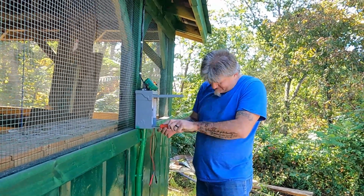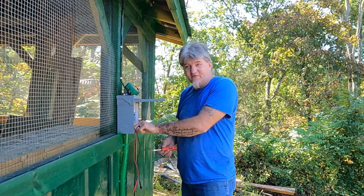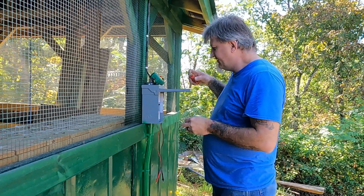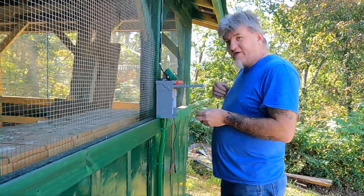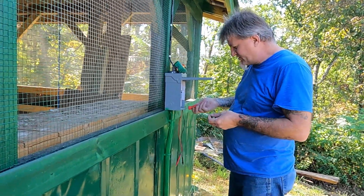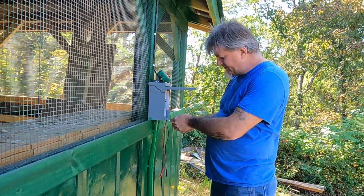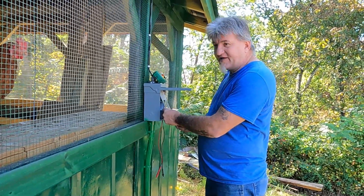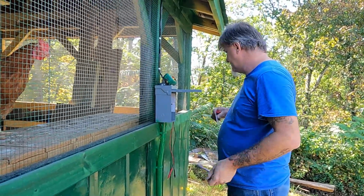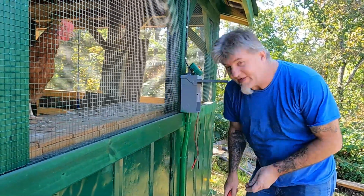I don't know if I put it in there or not, but anyway, in the video, you'll see me get the piss shocked out of me back there. I don't really think it's the, well, it has to be the solar panels because that's unhooked. But the solar panels right now is putting out 199 volts. I just checked the charge controller. And I got 199 volts coming off the panels in here. So, I mean, that's enough to kill you, if that's truly what it is.